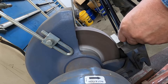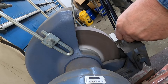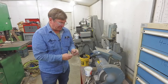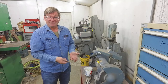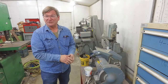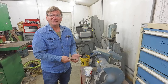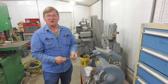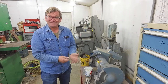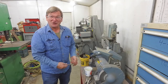Reducing pressure when dressing helps knock off the higher spots rather than just following the wheel's shape, though having an actual guide is what makes it best. You want some kind of water to cool the bit as you grind it - for two reasons. One is avoiding changing the heat treatment: if you get it super hot and quench in water you could make it more brittle because this is an air-cooled steel. If it slowly cools after getting too hot you've made it a little softer. The best is to keep it under about 500 degrees.